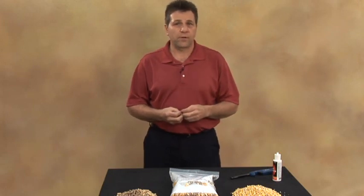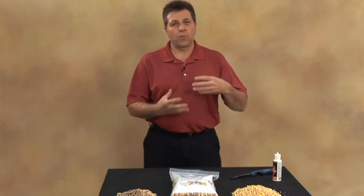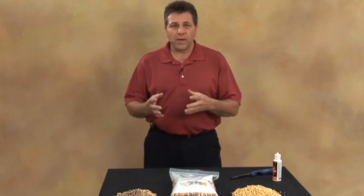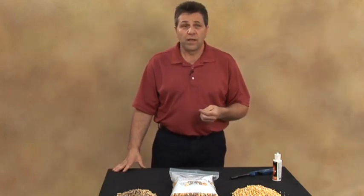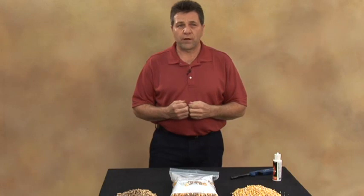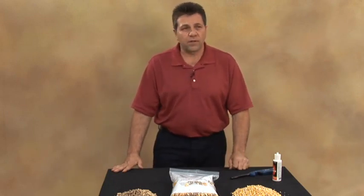Make sure and talk to your supplier about the quality and the consistency of the fuel, and try to get it from one consistent brand so that your stove can be set and work on that all the time. The same goes if you're burning shelled corn. If you're buying shelled corn from numerous suppliers, you're going to run into inconsistency. You might find corn that's around 10 or 11% moisture. You might be buying corn that's 15% moisture, and it's all blended together. That's why you want to get a good, consistent fuel supplier, so that you don't buy either the higher moisture or just simply the lower moisture. So find yourself a good, consistent supplier whenever you go out and get fuel.